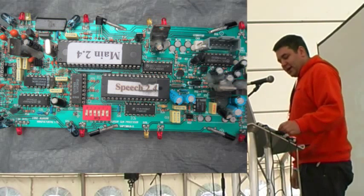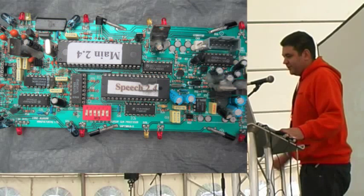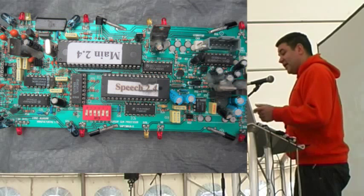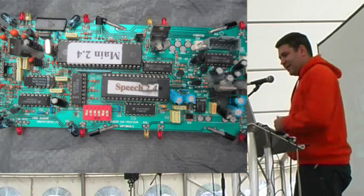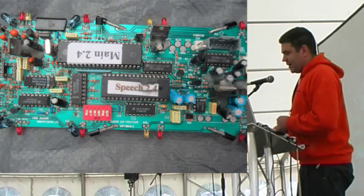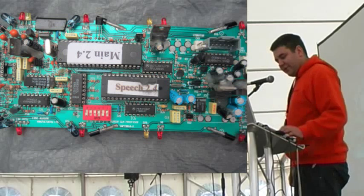The circuit board, because of its age, uses a very old infrared technology - individual infrared diodes to receive the infrared signals. All of the little black pieces around the edge are the infrared receivers. They're only two legs, and what that means is that it gets an analog signal that it has to decode into a logic signal. It does that at the front of the board.